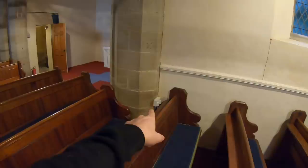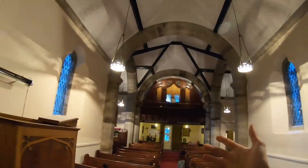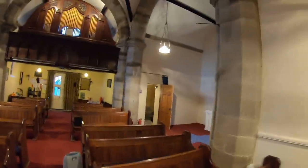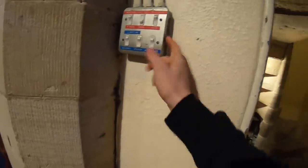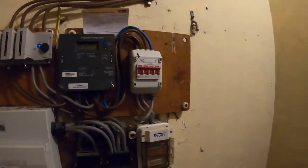You can see a double socket there - water's got in the back of it, mineral cable all the way up. I'm going to end up tucking all my cables behind on these rafters. The recommended new heaters are the new IR ones, pushed up to the top. Two new floodlights to go in. I'm going to keep the same light fittings to keep in form with the church but change to LED spot beam lamps. Through the architect, cables have to be hidden and run where they were originally. There's no organ anymore, it's just for show.